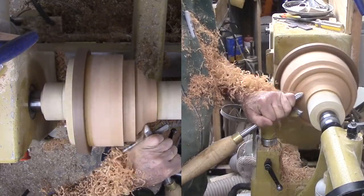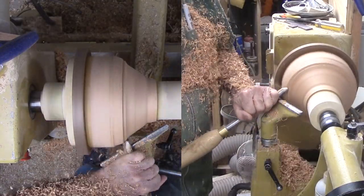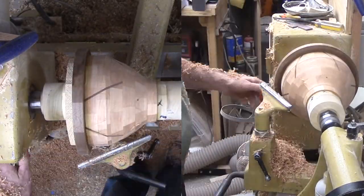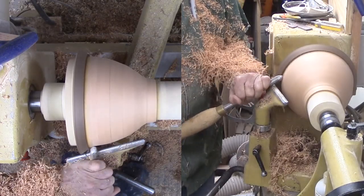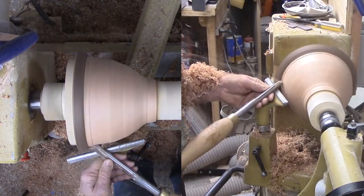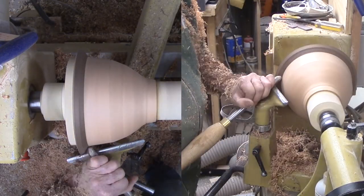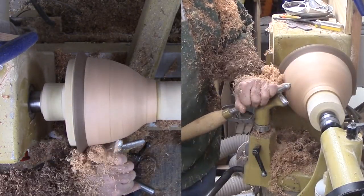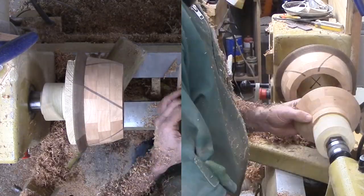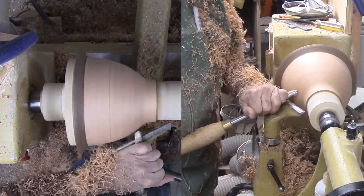Now the bowl is in two pieces, top and bottom. Both pieces are still mounted to faceplates. The bottom piece is on a bearing mounted live tailstock chuck adapter so that it can revolve without being secured to the top piece. Since I did not formalize plans for this bowl, I now trim the exterior to a pleasing curve. While I am doing this, I am aware of the internal diameters that must be respected. Since the pieces are not attached, I can take a quick peek to be sure the interior is working also.